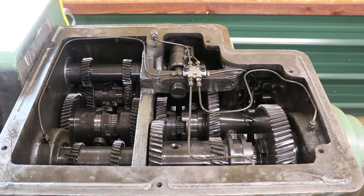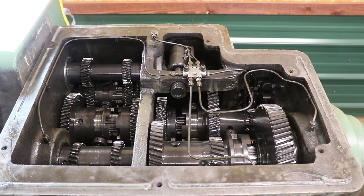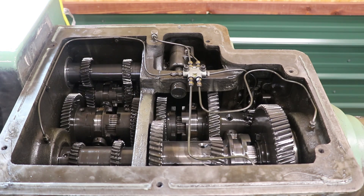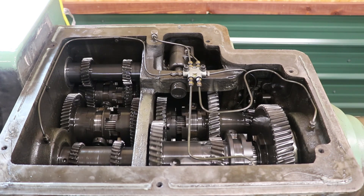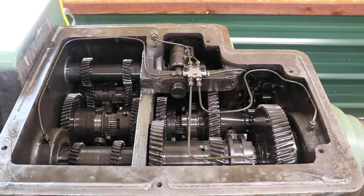Anytime I get a new machine and really start looking at the gear train, having not been into it before, you're always nervous because you just don't know if a machine was taken care of, abused, or just neglected over the years. I was very pleasantly surprised when we got in here — I was very happy to see that things are in good shape. I'm hand spinning where the belts come on and you can see I've looked at all the gears, all the splines, and I do not see any major problems — really not even minor problems. All the gears appear to be in good shape, there's no excessive wear, there's no missing teeth. So very good sign. I'm pretty optimistic that once we get the power back on this, get this plugged up and motored up, that everything in here should work fine.